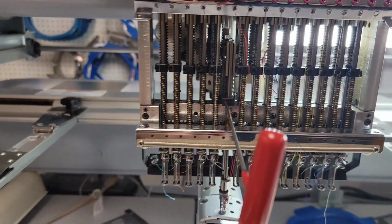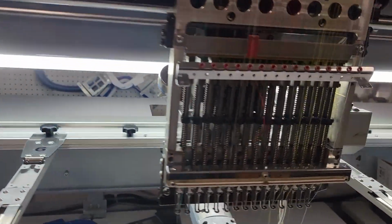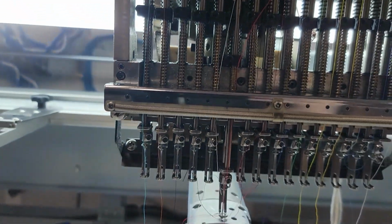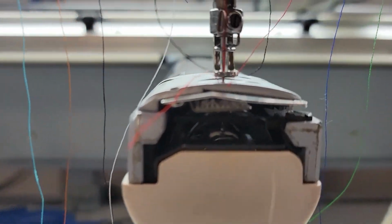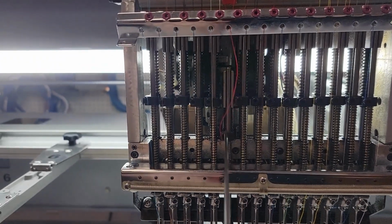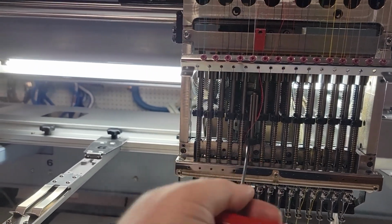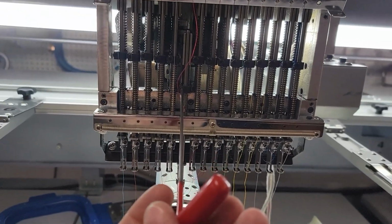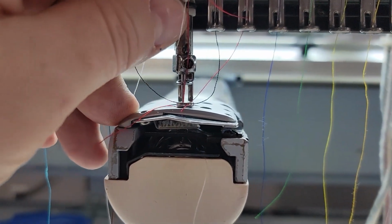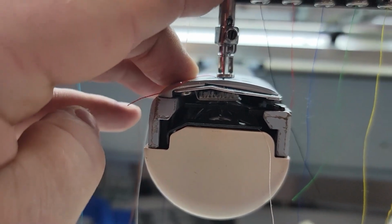But for the Z-head series of machines, you have to do it for each individual needle bar. So as you go down to each sewing head, you push down on the needle bar to lock it down in place, then you make your adjustment. You go to your automat and then go to the next needle, then go back to the upper shaft, rotate it back down to 0 degrees, plus or minus 1 or 2, and reset them all again. Unlike the S head, which is the next generation of needle cases for the machines, where you can set it by the K4 cam, here on the Z heads you do have to go to each needle bar individually.